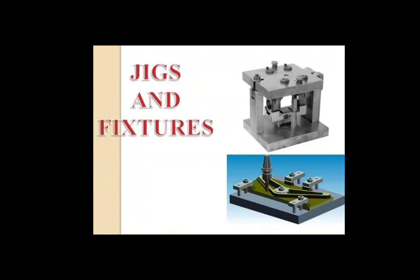When we talk about the position of clamps, it should be such that it contacts the workpiece at its most rigid point. It should avoid any damage to the workpiece. It should avoid bending of the workpiece. It should not interfere with the machining operations. It should not obstruct the workpiece loading and unloading path. It should be arranged directly above the supporting points. In case of brittle workpieces, fiber pads should be provided between clamp and workpiece.